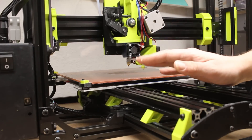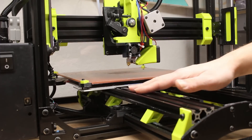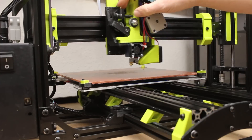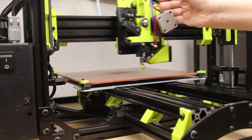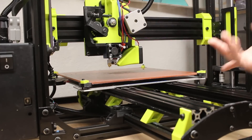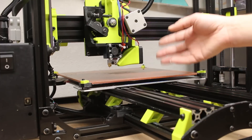I've changed from the rods to an open rail system. It's a little more beefy when the head moves now — it doesn't dip down near the middle of the build plate. It allows me to level the bed better and get more usable space.